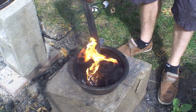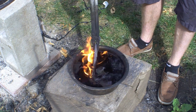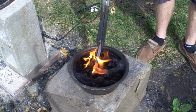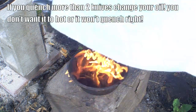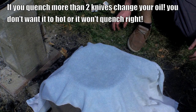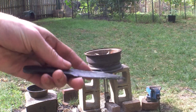I carried both knives over into the water because I didn't want the oil getting too hot for the second knife. Normally with a small knife I just dunk the whole thing in oil after 15 seconds. As a safety note — oil can combust pretty easily. If that happens, just throw a towel over it. The first time I had this problem I ended up burning my face. Pull the towel from the far side away from you so if it re-ignites it won't explode in your face.